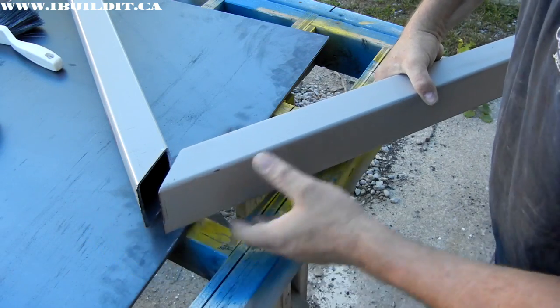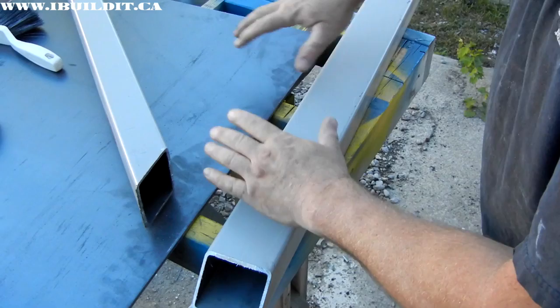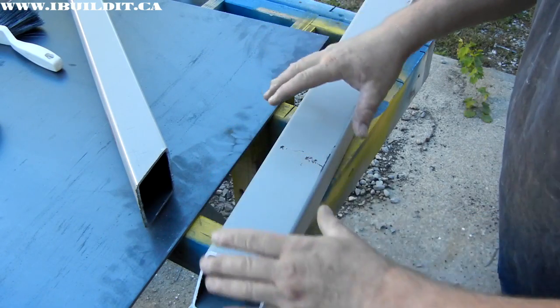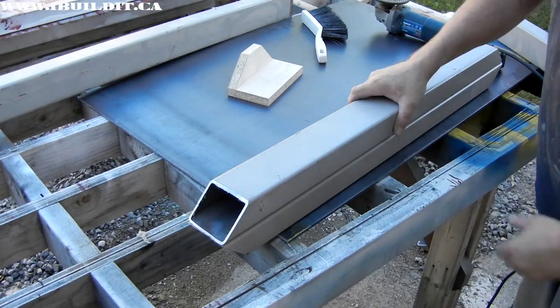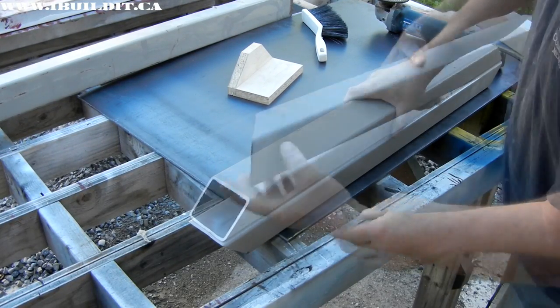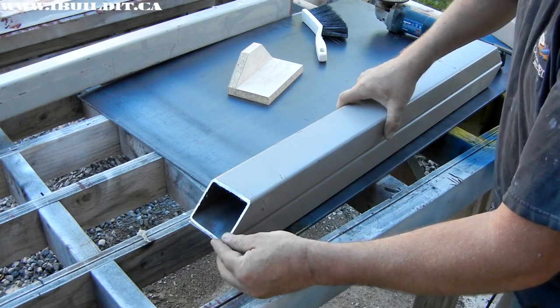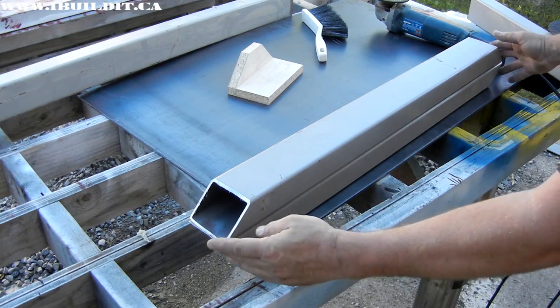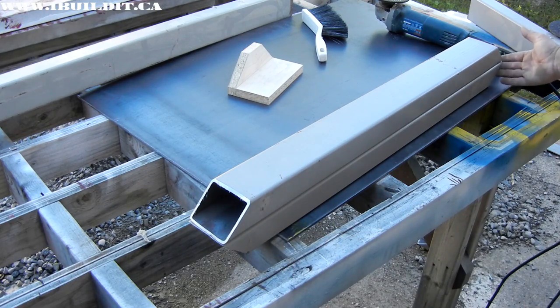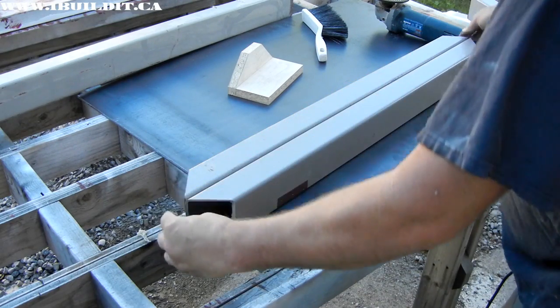It should go together nice and straight. I'm going to clamp it down to this — this is the metal that will make up the top right here. I'm going to shim this up nice and flat and level and clamp these members down to it and weld it up from there. Both of the longer members are cut. Now is the time to deburr this edge on all of them and then compare the overall length of the two. If they're wildly different then you'll have to grind some off to make them close, but these are pretty good.